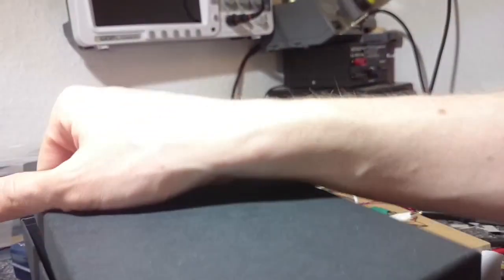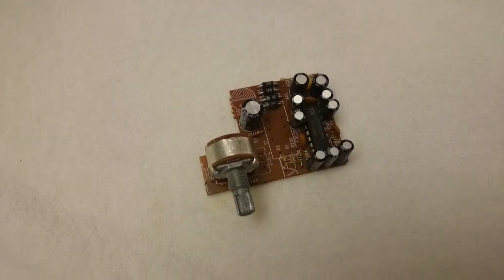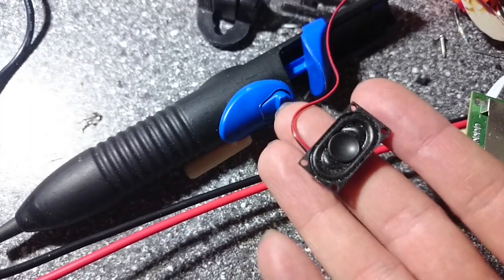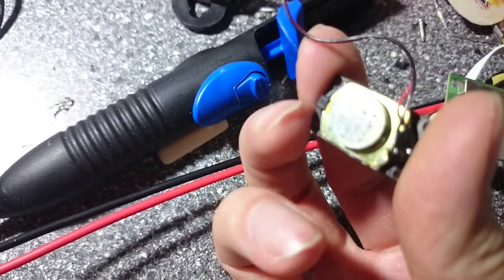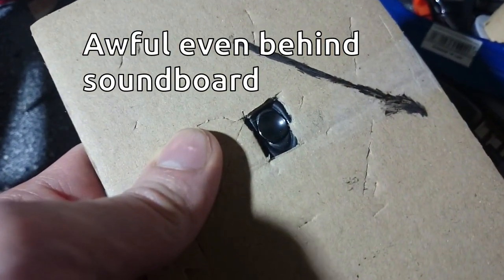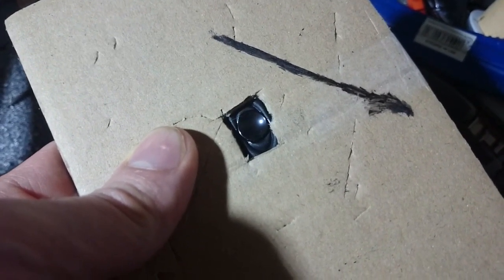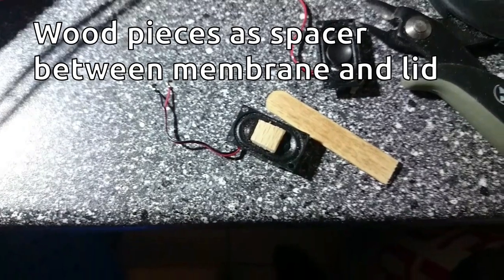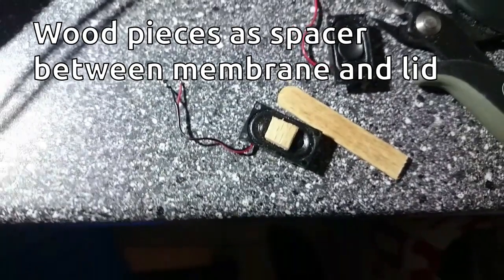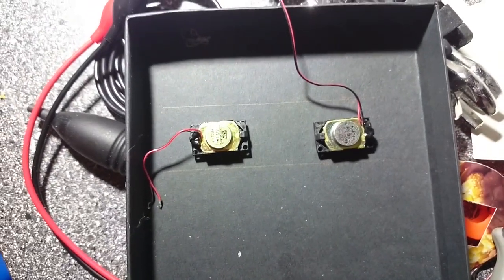My projector also has built-in speakers. I didn't want to put effort into speakers at first, but then I found this old amplifier board that runs on 5 volts and also these tiny, really crappy laptop speakers. They sound awful because of their small stiff membranes, but they qualify for an unusual hack. I glue them to the lid of my box — not with the frame but with the membranes. When they are driven, the hole acts as a resonator and gives me a half-decent sound.